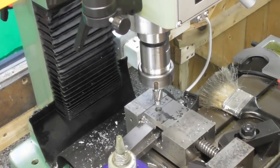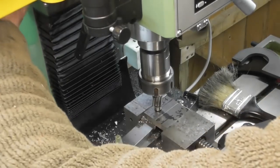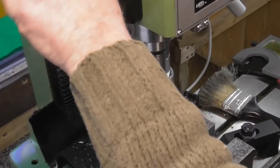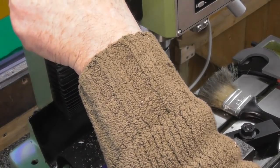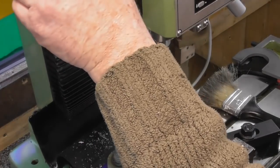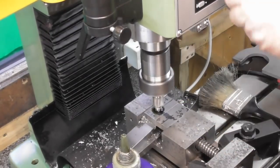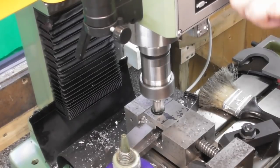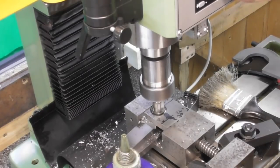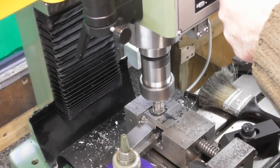So I'll try and do it with a quill instead of using the sort of drill function. I'll wind it down gradually with a quill. So yeah, fire it back up again. I don't know what speed you run this at. Yeah. Seems to like that speed. Okay. Get a touch off, set a 0. There's a touch. So what did we say? 8.5. We'll leave 4 mil in the bottom.